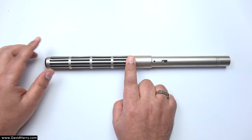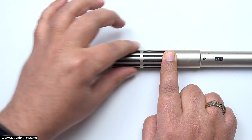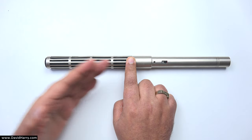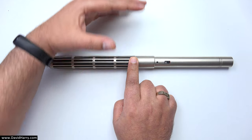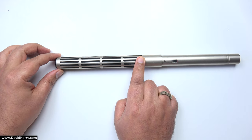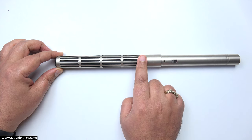What I'm going to do is basically explain the basic principles of what the interference tube is for — I will do a more technical video in the future. What happens is: this tube, by way of the design of its slits or ports, helps to reduce by a process of natural cancellation whatever is coming in from the sides. So sound waves coming in from the sides get cancelled naturally within the interference tube. Once you start cancelling sounds from the sides, whatever is coming through the front will naturally sound louder, giving extra clarity to whatever the microphone is pointing at. That's an overly simplified explanation of how the interference tube works in conjunction with a super cardioid capsule.